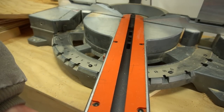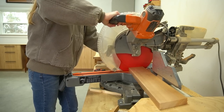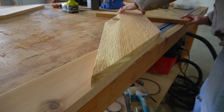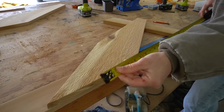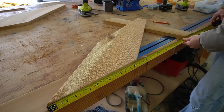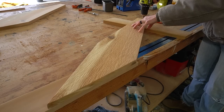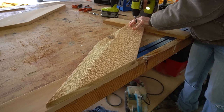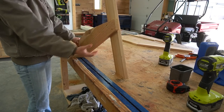I brought the 1x4 to the miter saw and cut two front legs with mitered ends at 20 degrees. All the angles, dimensions, and cut diagrams can be found in the plans linked in the description. Then I attached the front and back legs together. I laid one back and one front leg on the workbench so the bottom of the legs were even with my workbench edge. I used a scrap block under the back leg to keep everything flat. I arranged the pieces so the bottom edges were even and the top of the back leg intersected the front at about 14 inches up. I pre-drilled the holes first, then applied exterior wood glue and secured with one and a quarter inch screws.